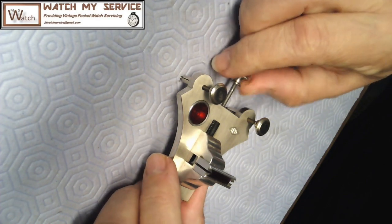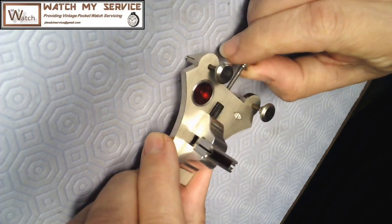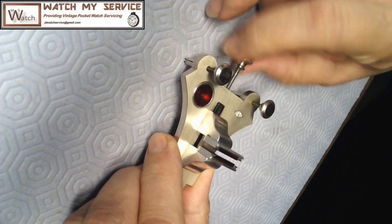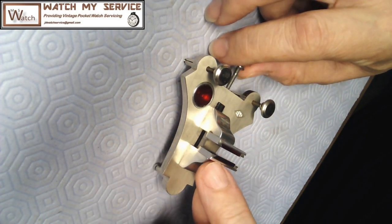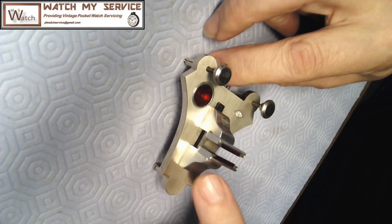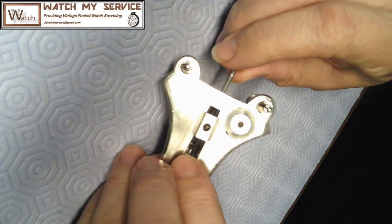In this case it's absolutely perfect. This particular poising device has metal on the outside that goes higher than the little sheets of ruby, which is made to protect the edges so they're not marred at all. These are adjustable by a screw on the inside as well. That's the first thing - and for this one I added oil to the back. It's a little slower to level but you want the poising device to be absolutely level for better results.